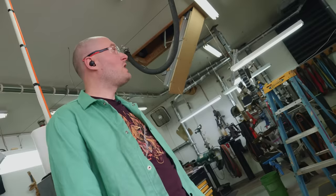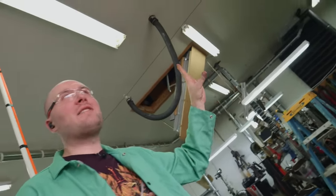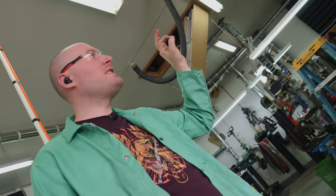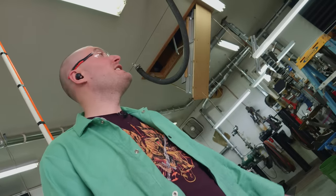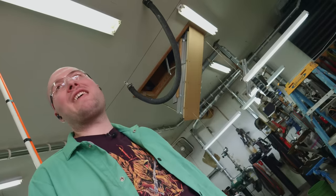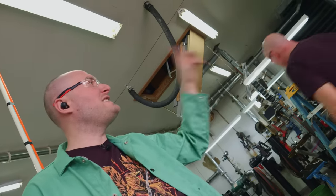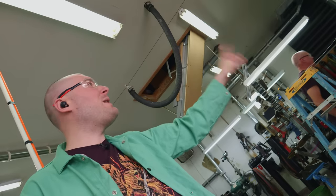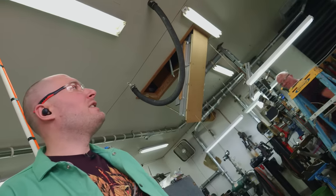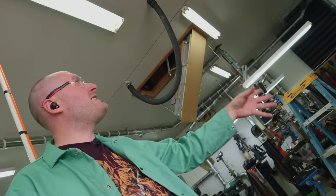Josh, somebody at the Blade Show was telling me that he did this salt heat treating outside, and even just a bird pooping in the salts, the moisture and the liquid in the poop set off the salts and made it violently erupt out of the thing. That's why you don't want to put your face, and you want to keep your hands to a minimum when they're over that tank, in case any little tiny bit of moisture gets in there.